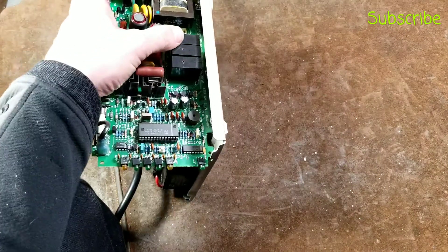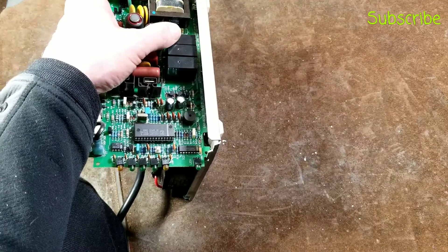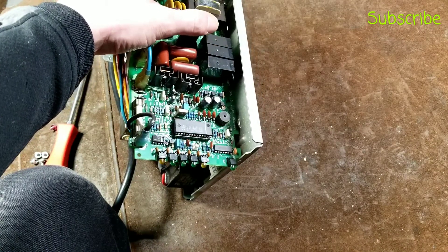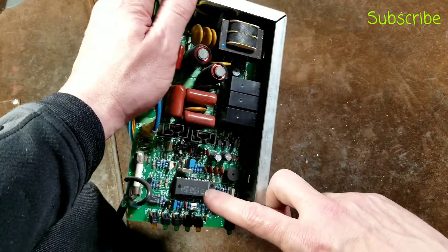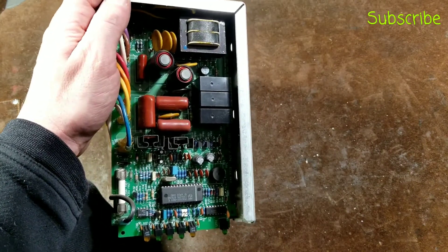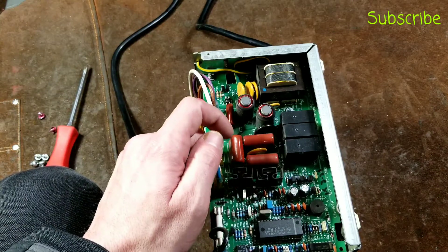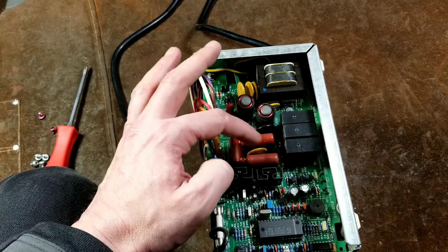This unit has three relays. Essentially there is a relay for the neutral position, and then it will click if it needs to do a voltage boost or remain off for a voltage drop. The other two relays switch these windings: one relay controls whether it's going up or down, and then two other relays control the two upward steps and two downward steps. The copyright on the circuit board and control chip is 1993 — so this thing is 25 years old and still works exactly as it did from day one. Really a testament to how good APC equipment was back in the day.